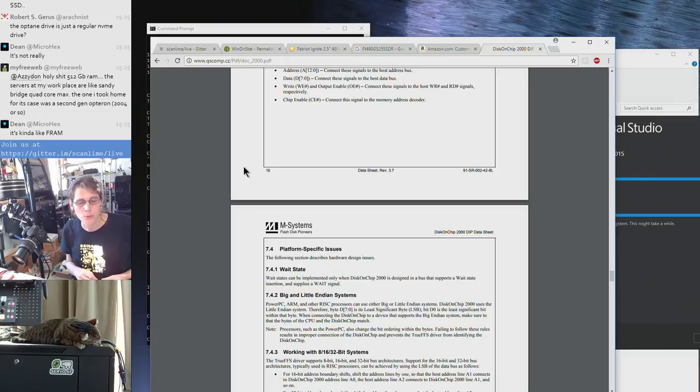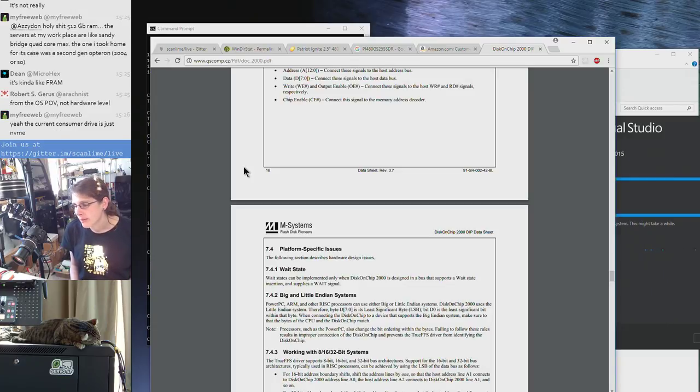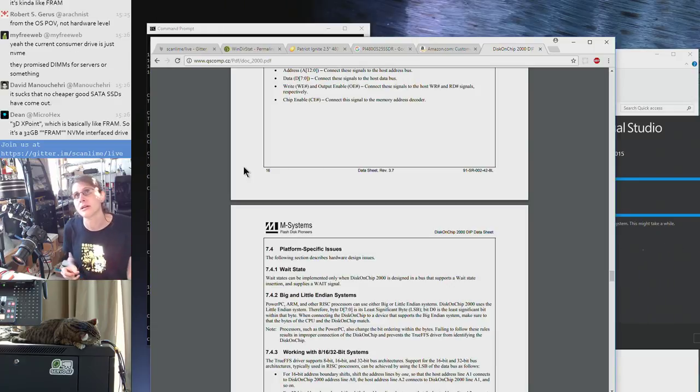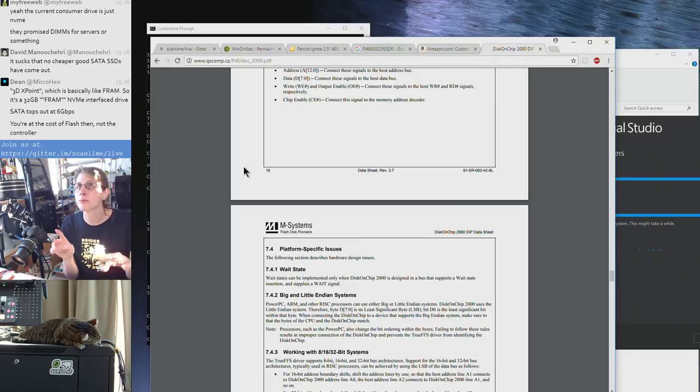It was basically this one very coarse-grained file allocation system that knew how to allocate and map 128 kilobyte blocks of the Flash. And then within those blocks, things were linearly mapped. Mostly it was that we didn't want to reserve all the RAM that would be required for a cache of a fully associative mapping table. So we wanted the bulk of the game's mapping to be linear, but to still have wear leveling and journaling for all the small bits of data we were writing to Flash. So inside those larger volumes, we had a smaller journaling system that would grab one of those 128K chunks, and then inside there, it would fill it up with a repeating journal. And then you could take a bunch of those and chain them together so that you'd have a bunch of static stuff in Flash that would not be wear leveled except when you reinstalled an application. But around all that static stuff, you'd be wear leveling within all the free space. So that was kind of interesting.